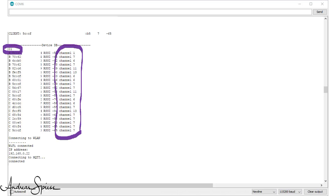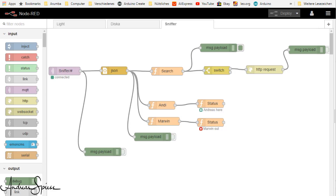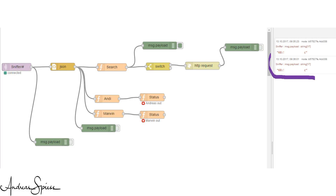As a result, we have a list of discovered MAC addresses. We can do some cool things with this list. First, we can detect if you are at home and switch things on accordingly, or switch them off if you are out. Other than PIR or radar sensors, these sensors can distinguish between persons. Or we build a database of known devices for family members, and as soon as an unknown device is detected, we can trigger an alarm. The big advantage is that we can hide these devices completely, and we do not need a sensor for each window or door — one sensor is sufficient for at least one floor.